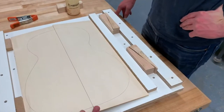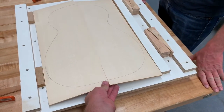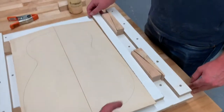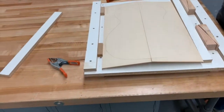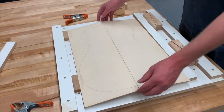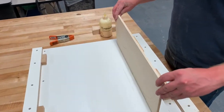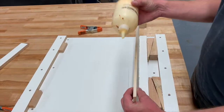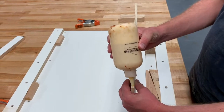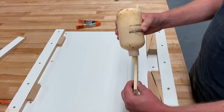Come to our jig here — this is the same one we used to glue the back together, so you should be familiar with this process. We have our little wedges here. Get the front in place, tip it up, and get some glue on those edges. Use this little jig to glue it together. You don't need a ton of glue — just a little bit spread around so it covers the entire edge of both boards.